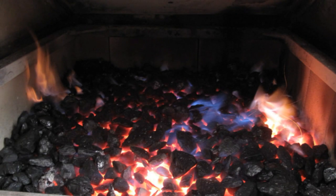Anthracite coal produces a lot of heat but can be difficult to ignite. The traditional method is to layer coal on top of a well-established hardwood fire, but people have looked for quicker methods and have resorted to using coal mice, pieces of road flare, and even propane torches.